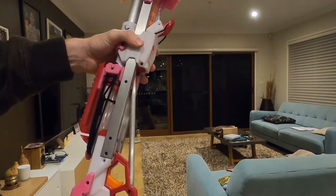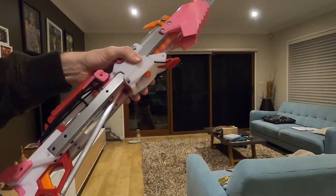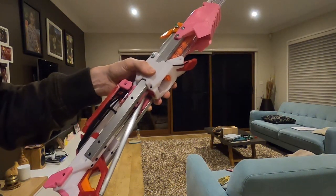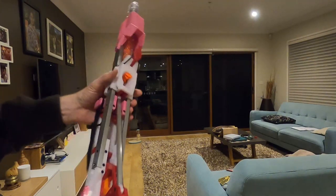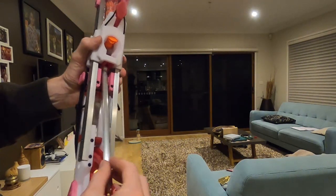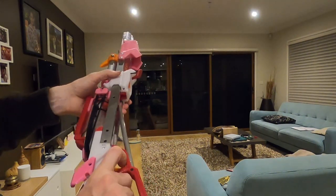This part here — I've made the linkage out of aluminium and honestly it should have been aluminium from the start. The three-piece plastic linkage is actually pretty crap; it flexes, you have to worry about the take-up, you put a bit of spring load on it and tune it, and you do break them. So all of this is now aluminium. I've printed some lugs and epoxied them on the inside so the lugs don't take any stress — it's just to keep a straight tangent on the linkage.